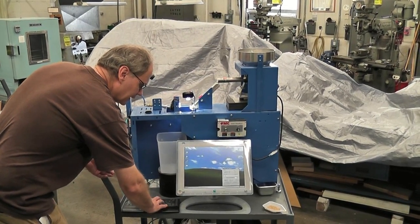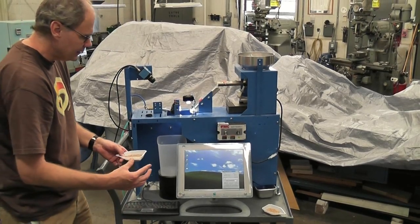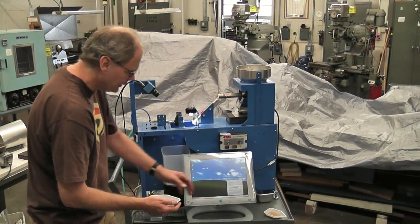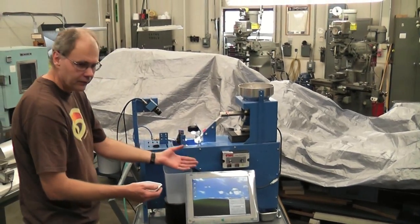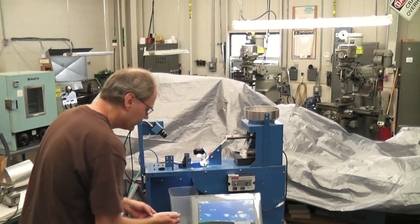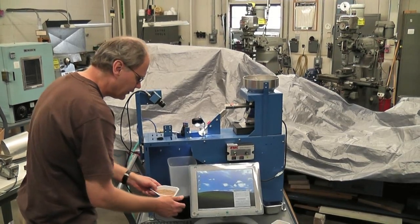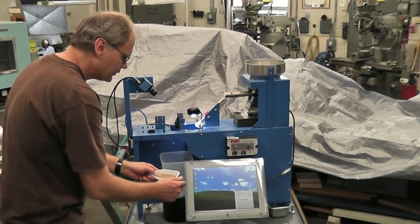That's what we'll use to calibrate the machine. To do that, we need to save data and images from 200 red wheat kernels and 200 white wheat kernels, or whatever it is that you want to be able to sort. The first thing we're going to do is save data for the red wheat kernels, and we're going to call that the dark kernels here.